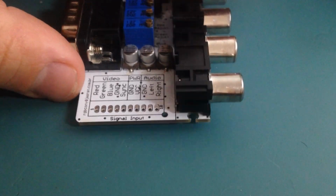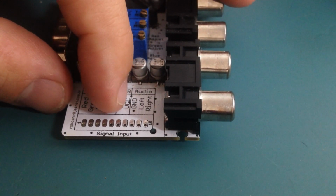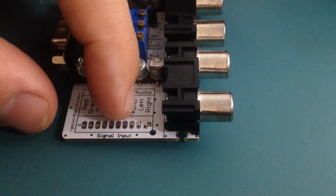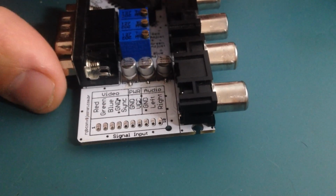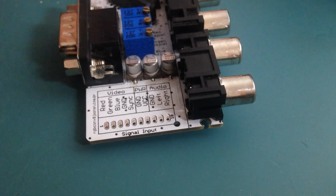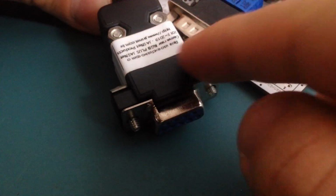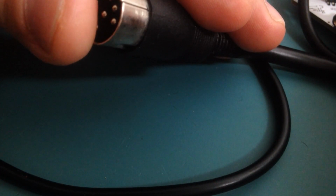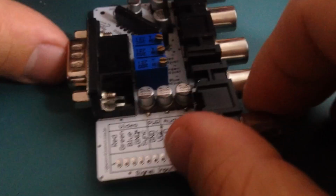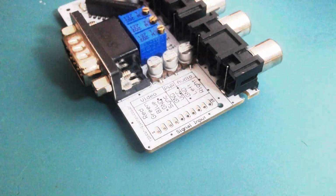In the next video I may change this board and use an external power supply too, because as you can see here it already has the input, so I may solder a few wires here and use an external power supply like a USB 5 volts, so I can power it on without using the 5 volts from the console. So I also have to change this connector, remove the parts that use the 5 volts from the console, disconnect this 5 volts so I can use the external power supply to power this board, and see if that helps with the overheating regulators.